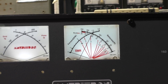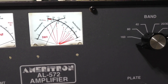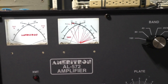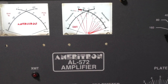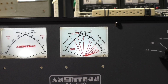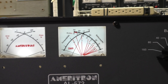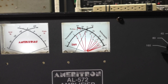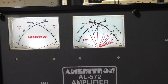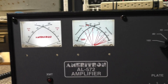Alpha has been doing automatic bias for a long time, but it's nice to see Ameritron doing it here — saves wear, heat, and tear on the tubes. On my recent Heathkit HL-2200 video I keyed it down and the low bias was hitting the tubes pretty hard with limited drive. This amplifier eliminates that problem because the variable bias tracks the drive/output, so the tubes only work when they need to.